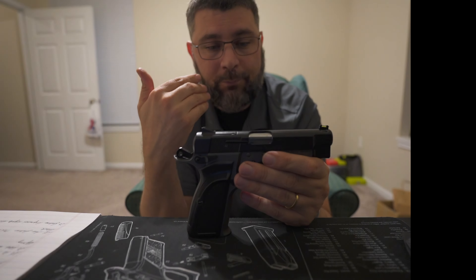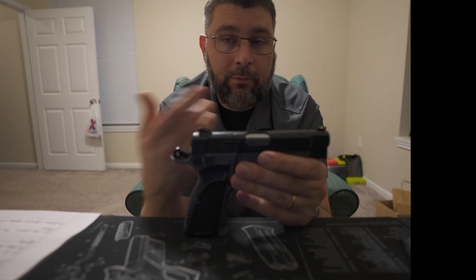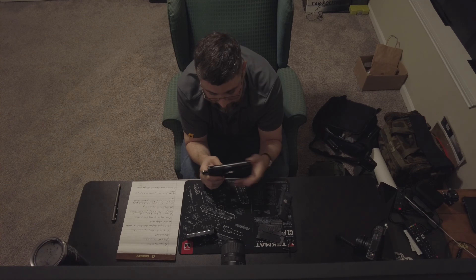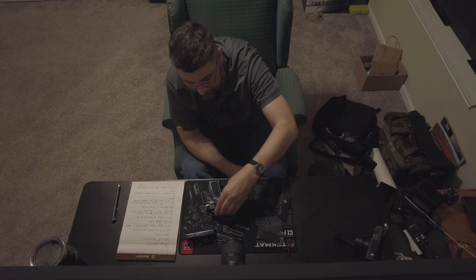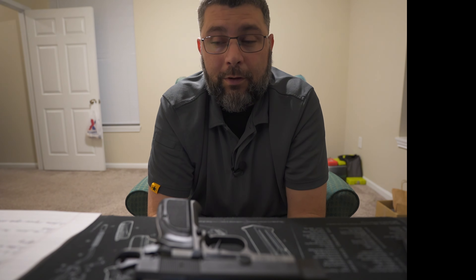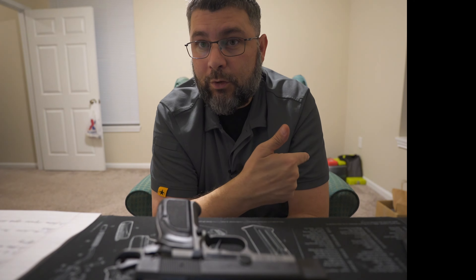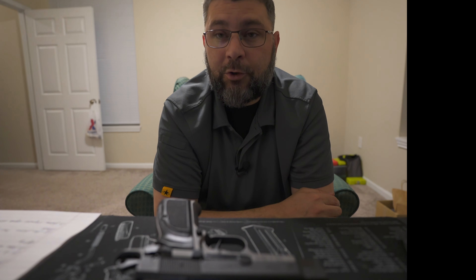This is a very nicely rifled barrel with a nicely done target crown. The chamber is polished — I did not do that, it came that way from Turkey. Kudos to Gerson on the barrel. There are forum posts where people talk about Gerson barrels not shooting right in their High Powers — I'm reserving judgment because I haven't noticed any issues whatsoever. The whole point of polishing all of these surfaces is to provide a smooth, friction-free engagement surface. A smooth gun is an accurate gun is a great-shooting gun.